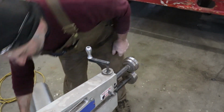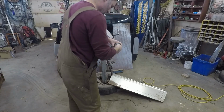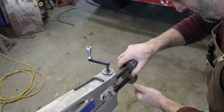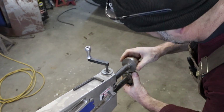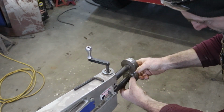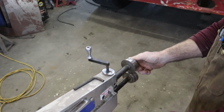So now I gotta switch these dies around so they're the opposites. All I gotta do is flip the upper and the lower ones. I put shims on because otherwise the dies are too tight. So that's why you see these. That spaces my dies out so I don't cut the steel. I can set my desired step.